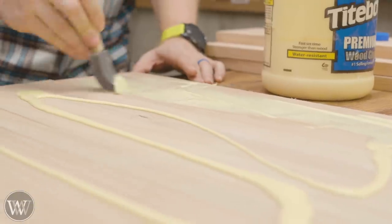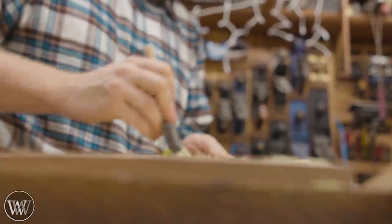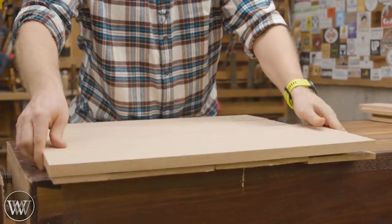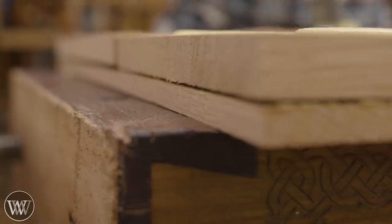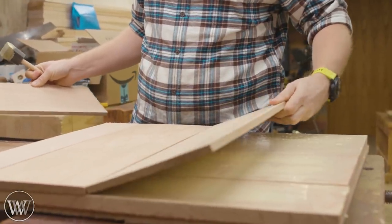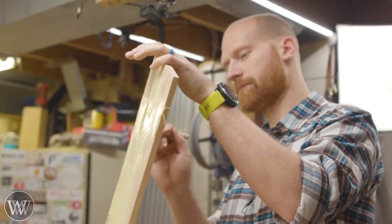I layered on the glue, slathering it around, making sure to have glue on all of the joints between pieces as well as a full coating on both sides that go down onto the surface. After spreading it all on, I set on one layer and then repeated the process again, coating the next layer. It's just three layers in this particular setup rather than doing a whole bunch of pieces of veneer. Then we can get to the clamping process, which is where I had a bit of a challenge figuring out how to get clamping pressure all the way around on all the seams.